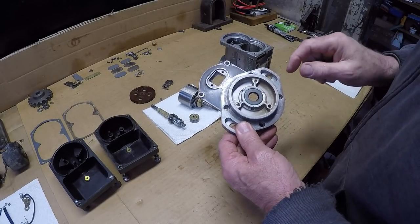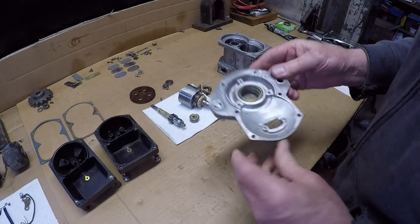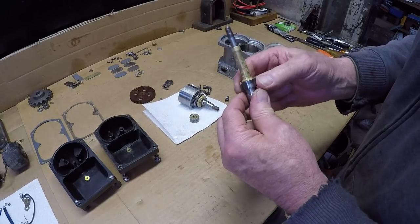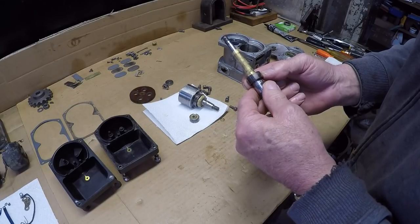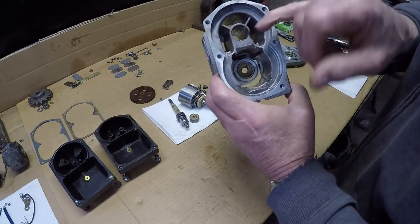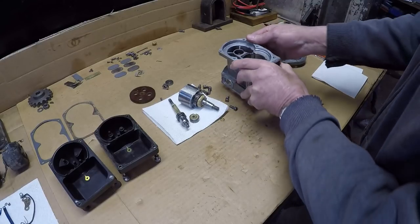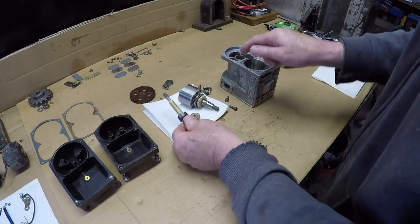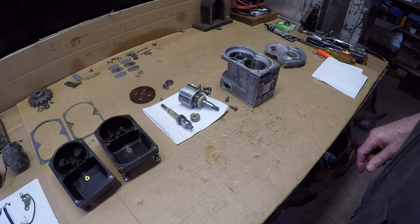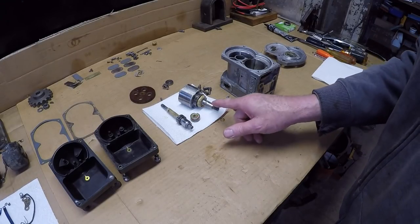Here we have the seal installed. We went through and got all the bearings packed — races, cones, everything ready for the rotor installation and the cam. Remember, this cam has notches in the bearings. If you look inside you have a peg there, and that notch has got to line up with that peg — you get one on each side. So when you put this cam in, make sure those notches line up with those pins. We'll get them pressed in, get the rotor in, then come back and show you how to time the cam gear to the rotor.